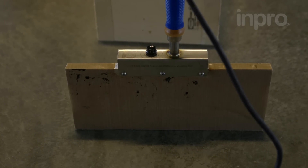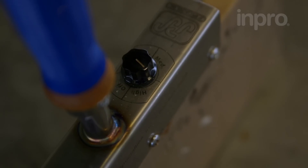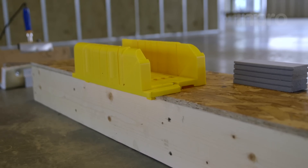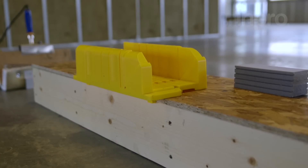Tools required are a hot plate, which will be used to create watertight seals and transitions in the foam. Adjust the heat setting of the plate to medium-high heat. You will also need a miter box affixed to a cutting surface. The miter box assures that you will be cutting straight lines to create transitions and seams in the compression seal.